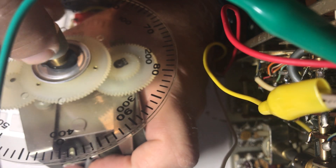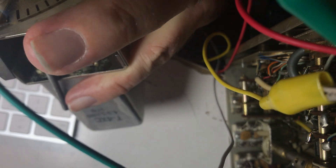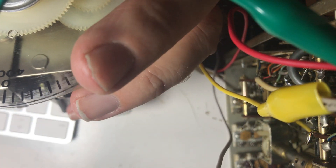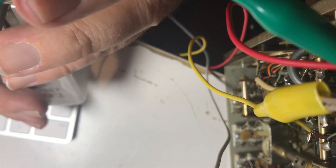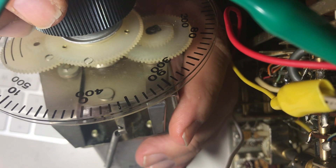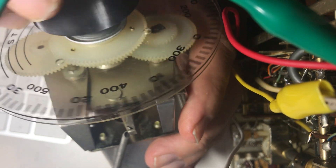All right, now we'll put this rubber piece back on and the frequency knob back on. Tighten it up. There's no easy way to change your frequency on these Collins PTO's - the old one you could swivel the graticule or something. This is pretty much nuts on now. Let's go to 3.9 on the SDR - on 80 meters, 3.9 should be right smack at 500.